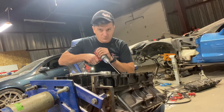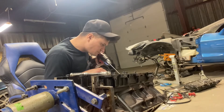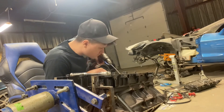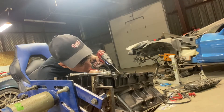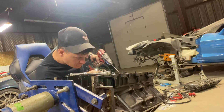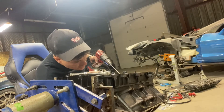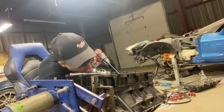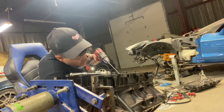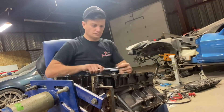I finally figured out with the bits how to not break them — not to say I didn't break six or seven out of the twelve I bought after breaking the first one. Go fast and then very slow until you know you're on a flat surface. That angle is just too tight on that main oiling groove. With such a broad head on the drill bit, it's very unstable as you're hitting two sides, with the other two sides not touching the bit. Until you get that bit down into the bore and it's completely surrounding the bit, you can't really put any pressure into it.